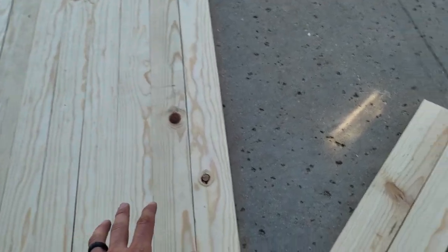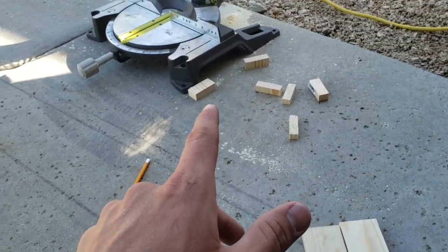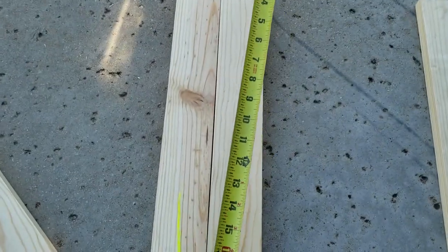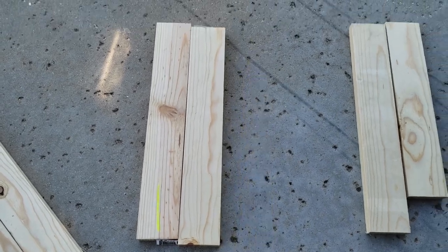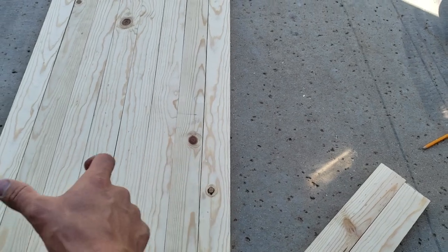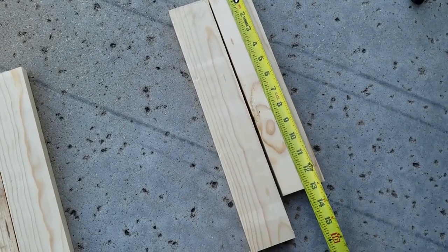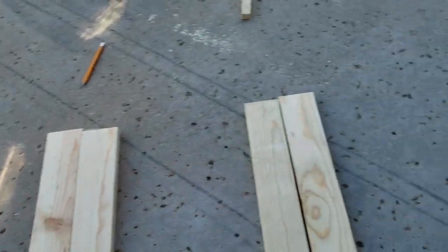Now that we've got all these cut, I'm going to take some of my scraps — they're kind of different sizes because I usually cut off the raw edges for these boards just so that they're nice and smooth. We're going to take two of them and cut them in half at about seven and a half inches. Those we'll use to hold each separate part together when we glue them. The other two scraps I'll cut at 13 inches, and those we'll use to hold the two bigger pieces together at the end.